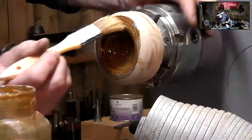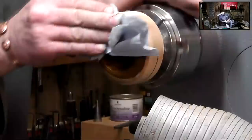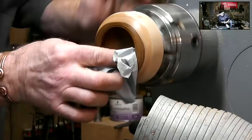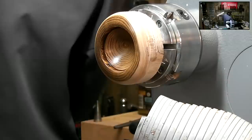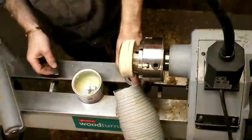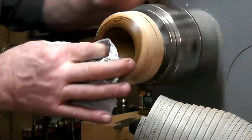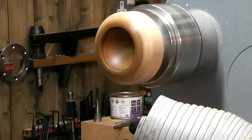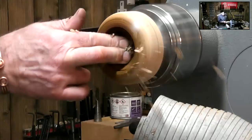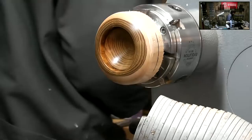This is where the skew really came about for me. I got given some timber when I was in Australia called Mulga - it's like turning lumps of steel - and it broke the tip off. These are a bit better because they're thicker sections, so there's more strength. The curve on the back adds strength to that tip. Check it's nice and clean. The reason we've done the recess before sanding: if you sand and then cut the recess, your fingertip is going to roll this corner edge. I want a nice crisp, sharp recess.